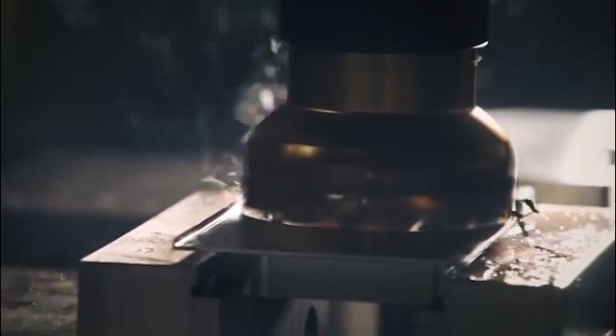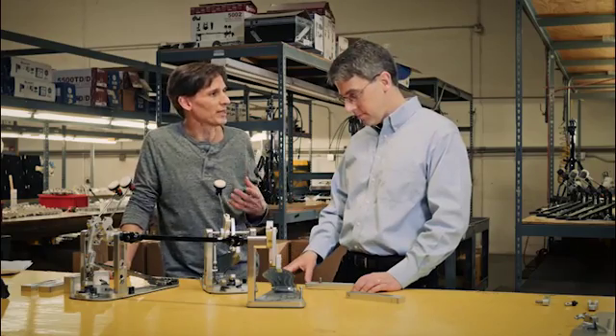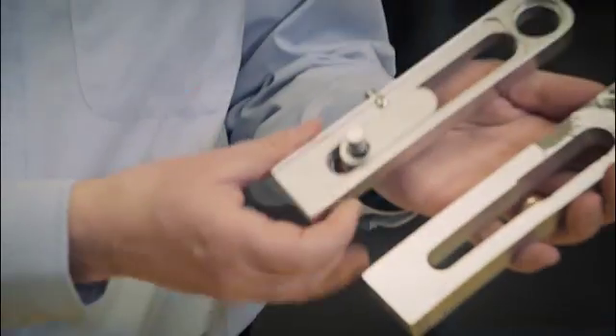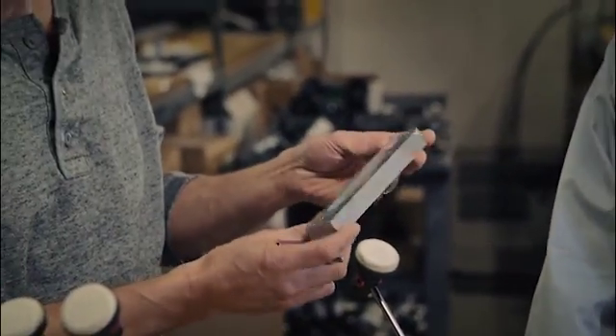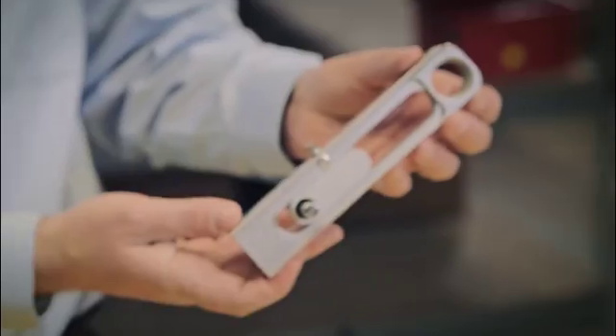Shell mill cutters remove material faster, but talk about the change that you made that reduced the amount of material you have to start with. Well, one of the things that has changed big time for us is when we went from the casting to a solid piece, obviously you're going to have to machine a little bit more. So we started to ask the question: what's in between there? What can we do to be able to machine it in-house, yet keep the cost reasonably priced? So we started looking at extrusions. Going with extrusions instead of solid billet, this will give us part of the shape we need. This particular part — by extruding this, we eliminate all of the cutting on the perimeter of it.